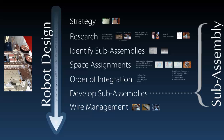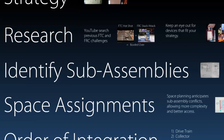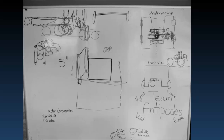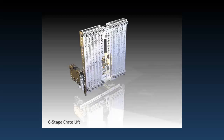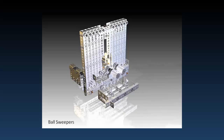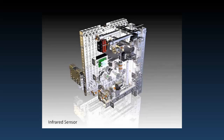After you've researched your ideas, it's time to identify what kind of sub-assemblies you're going to be building. A sub-assembly is a group of parts that work together to accomplish a certain function. Here you can see a couple of different ideas for sub-assemblies using the whiteboard. Our robot is pretty dense, so we created a buildup of all the different parts showing how the sub-assemblies work together. We start with the crate grabber, which we use to grab the crate that we lift into the air using our forklift, controlled by a winch and its drive motors. We get balls into the crate using rollers that align the balls to be lifted up and sorted before they're dumped. You can also see the different motors, servos, and sensors that go into making the robot.